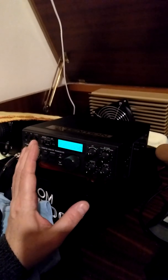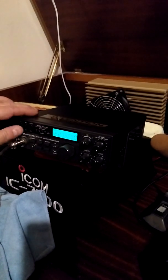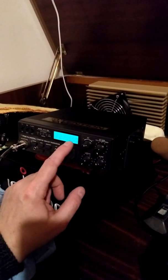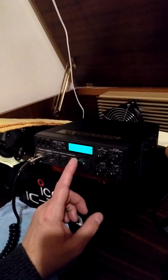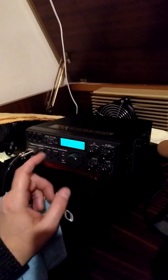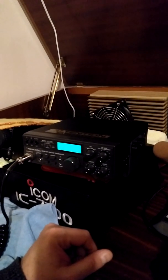I've not got an aerial plugged into it at the moment. It's on USB and LSB. But due to the design of the radio, you have to drop down 3 kilohertz on the VFO dial to get 12 o'clock on the LSB. The other thing is, when you go to CW on this, it's FM. Fantastic. And it is actually spot on there.